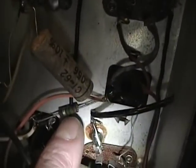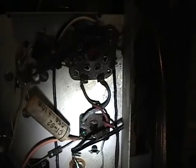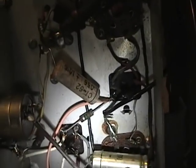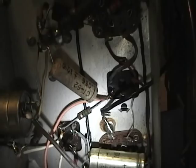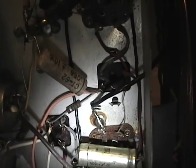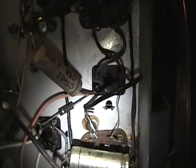This white wire here goes over to this resistor, which has brown, green, green on it. Well, a 1 megaohm resistor should be brown, black, green. This is actually a 1.5 megaohm resistor, which is not what the schematic calls for — which puts me in a bit of a bind. You can leave it in there, but you should test the resistors, and if it's off from the marked value, you should really replace it. If this measures out to about 1.5, I'll leave it in there — but when I fire up the radio, if it doesn't play as well as I expect, that would be the first thing I'd consider swapping out for a 1.0 megaohm as the schematic calls for.